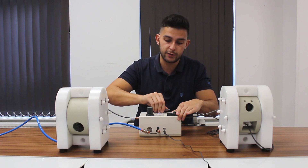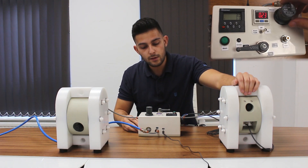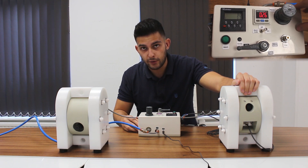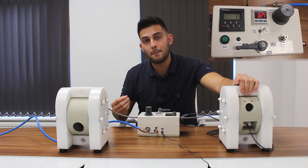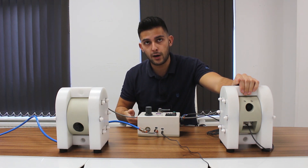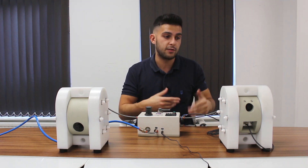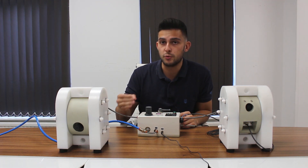If I switch that over to the LEAP technology, it's actually ticking over. So the first benefit you get from the LEAP pump is unparalleled levels of control. At 0.25 bar the pump's ticking over and it can't stall — there's no risk to the pump. At this pressure the priming is also much better because it's giving the balls a chance to seat.